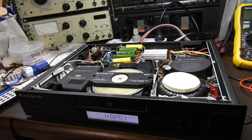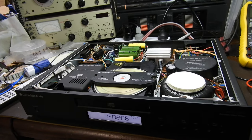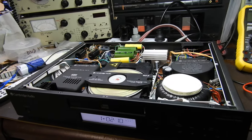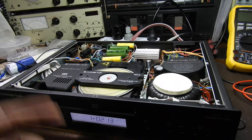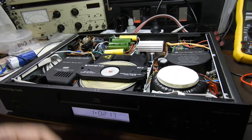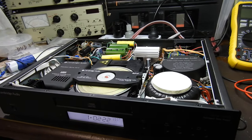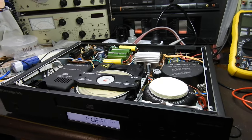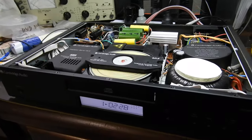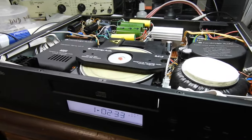There were just little cracks that are fixed with ultraviolet cure glue. This sometimes happens, and it was bizarre because the owner was still here when I looked at it. It just wasn't reading discs, wasn't trying to spin. We took off the bridge and without the bridge the player tried to spring into action. Obviously with no bridge and no clamp it couldn't, but the moment we fitted the bridge it wasn't going to work — which is normally what happens when you have all these cracks: the back twists and the clamp doesn't hold it properly.